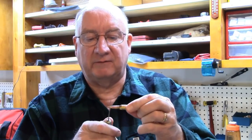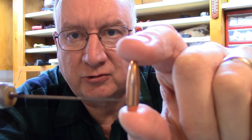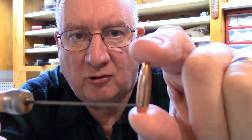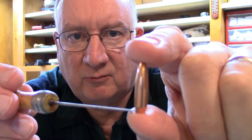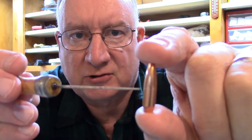If you've got a 257 diameter bullet, then the bearing surface, the shank of the bullet, should be seated 257 deep. That's to achieve correct support, so that the bullet doesn't become loose during chambering. And we're talking not about, never include that with the boat tail, any boat tail or anything else. It's the bearing surface of the bullet itself that we're talking about.